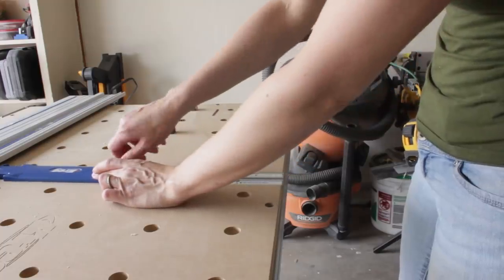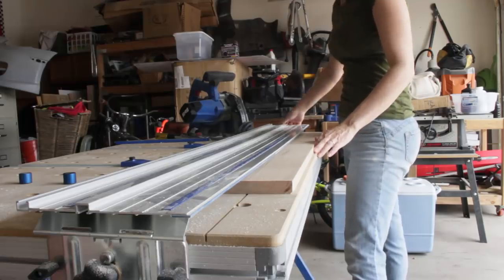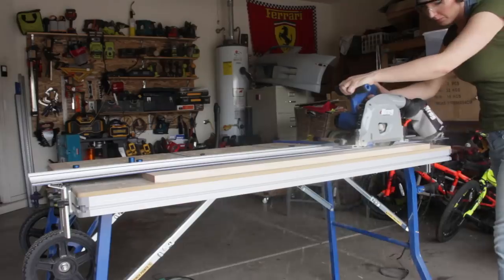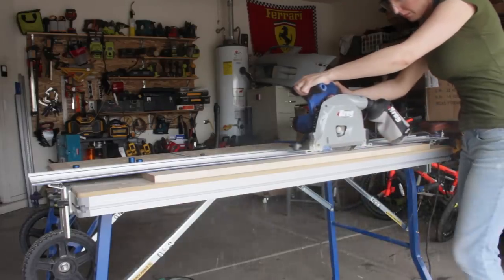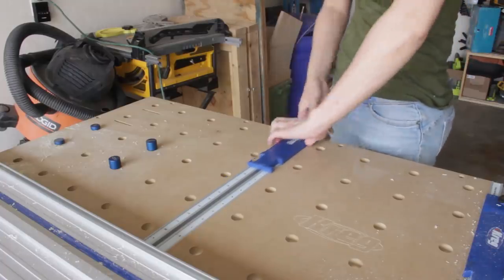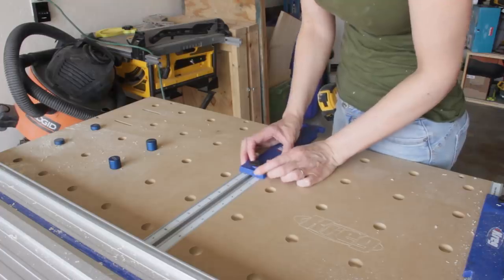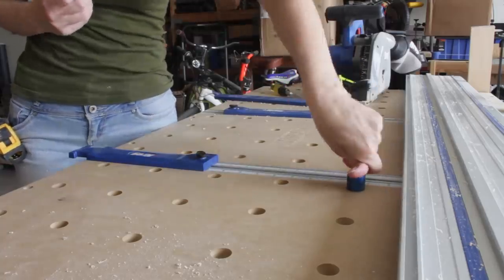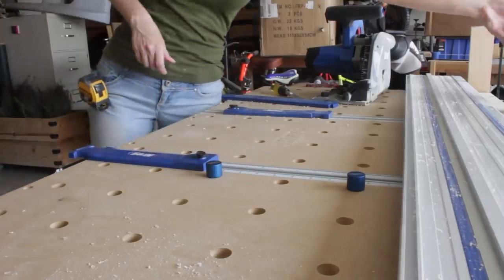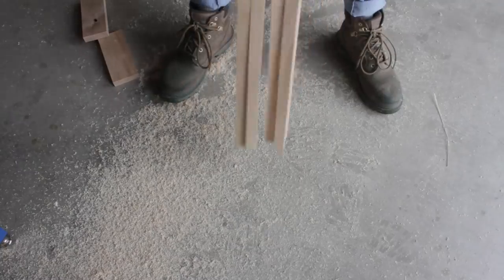I slid a pair of repetitive stops into the measuring track to set the width of the boards I was going to cut. After that, I was able to lower my track in place and then easily rip the board to the exact width I wanted, which happened to be two and a half inches. If you wanted to skip this step, you could buy off-the-shelf one-by-three boards instead. I flipped the guides around and dropped a couple of Versa stops into the tabletop to cut the length of my boards, cutting four approximately 16-inch long lengths.